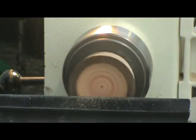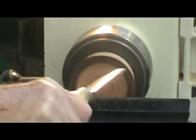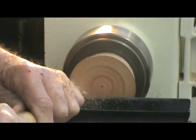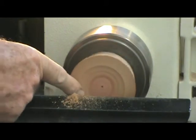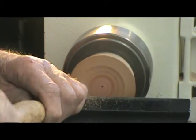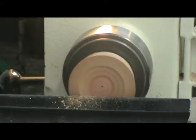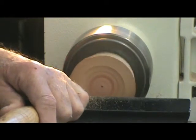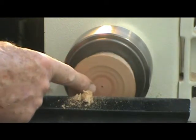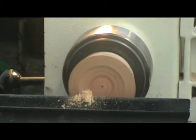Remember a long time ago we had a guy come in who wore funny things around his shoes — little wide ruffles on the side of his shoes. He showed me a trick: how do you get this perfectly square? I sight the point of the skew and the heel of the skew and try to line them up exactly with the surface. If it lines up, that's going to be square. I'm square right here.